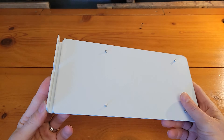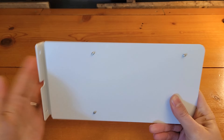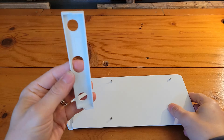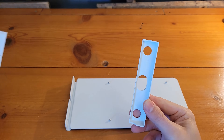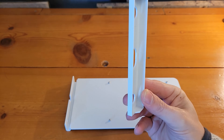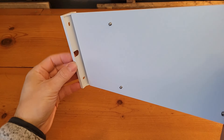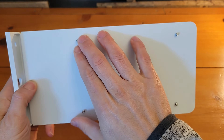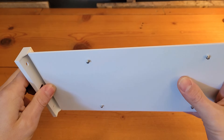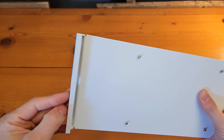If you're mounting to a door frame or window frame — whether metal or wood — instead of directly to the wall, there's a mullion mount option. You first align the insert on the frame to get it level, make sure the screw holes are in the right place, then drill your holes and attach the outer piece. The mullion mount sits right in there and connects through the holes. The multi-surface mount for the scheduler then attaches to the four screws, with a metal piece for sturdiness sitting inside the plastic frame piece.